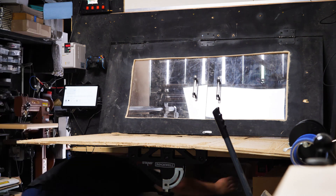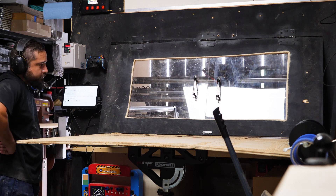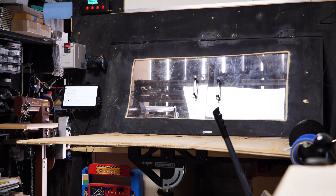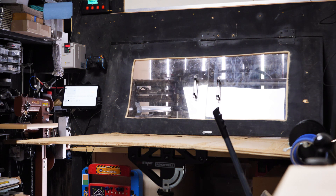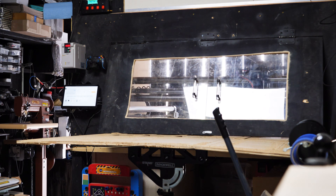That's basically it — you're just cutting one section, scooting a little bit farther down, and cutting the next section. I was super intimidated before I even tried this and never wanted to try it with a smaller CNC. But now that I have the four by four, I've done it a lot. Yes, I've messed up some, so you definitely want to double check that line — it's the most important thing. If you make your tiling section at 47 inches, you put your mark at 47 inches. It's not hard — I kind of love doing it now. It takes a little bit more time and cleanup, but it's not difficult at all. It's intimidating because you don't want to mess up the whole sheet, but once you get that alignment it's super easy.